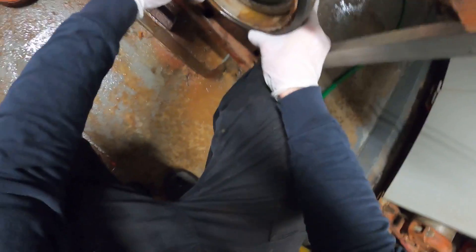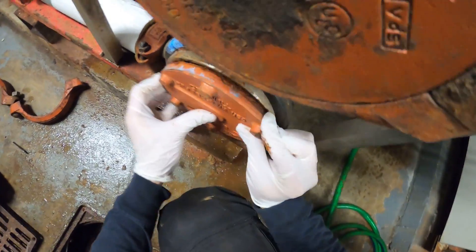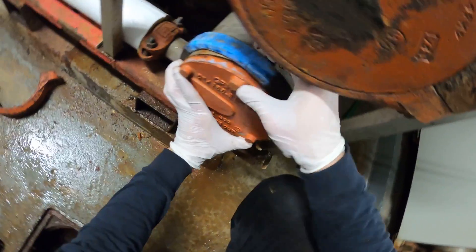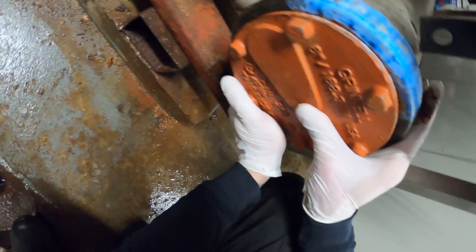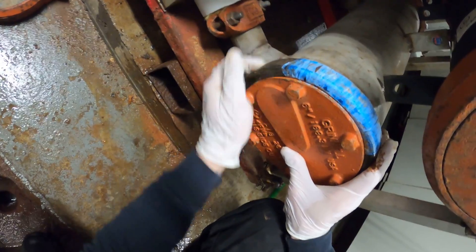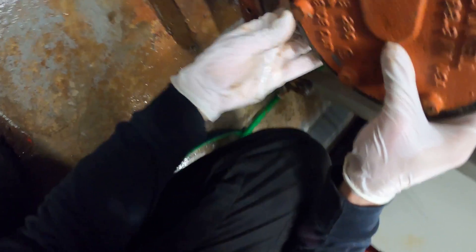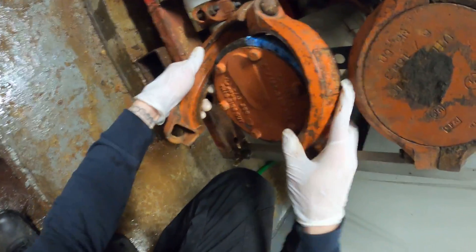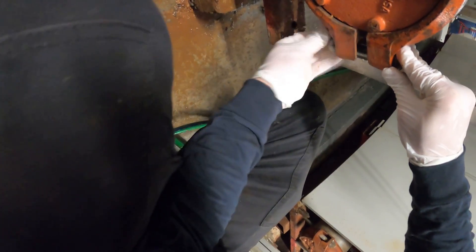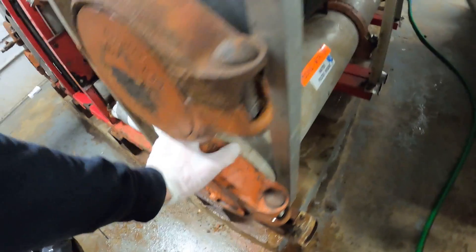Let's push this back — that's all done. We're going to put this coupling in between the two grooves, the gasket in between the two grooves, and the coupling around it. The plate should hold with the gasket alone. Let's even that out and then put on our coupling and tighten down these nuts. Everything's nice and snug, everything looks even.